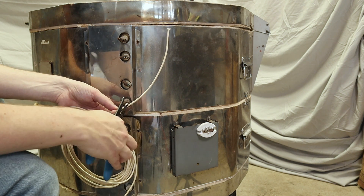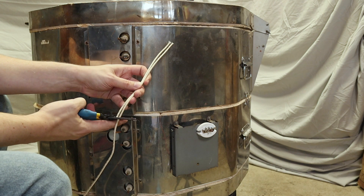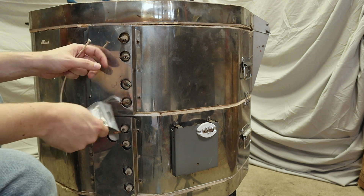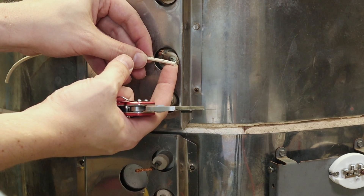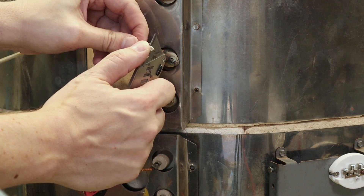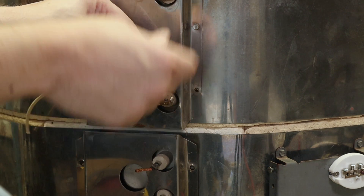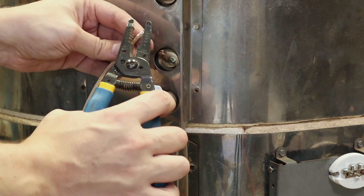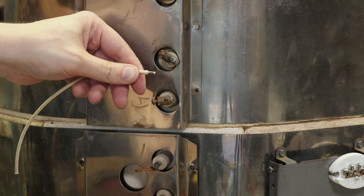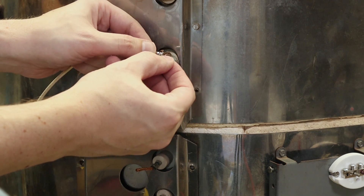I'll do the same thing on the bottom ring. Here's some wire I can use to go from the top to the bottom and connect those. Since the top has screw-on terminals, I'm going to use ring connectors. To remove the fiberglass sheathing, I take a utility knife and score along the outside edge since it's braided. Once the sheathing's removed, I cut off the insulation with a wire stripper. I've taken a piece of wire, stripped both ends, added a crimp-on ring connector, and crimped it down.